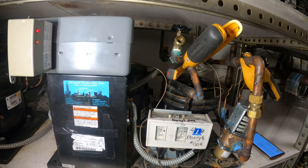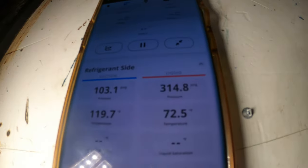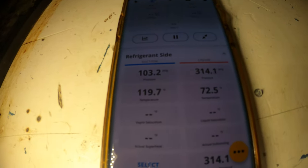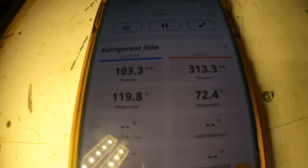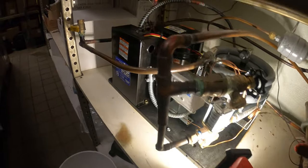So the outlet is 120 degrees and the inlet is 72 degrees — that is extremely hot. The head pressure went up to 350 and shut down. With this water-cooled setup, head pressure should be about 200 with about 40 pounds back pressure. We're tripping on high head pressure.